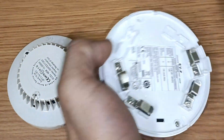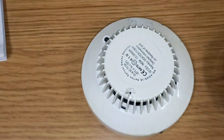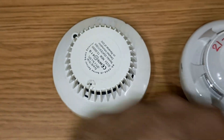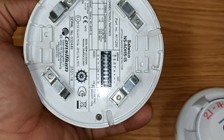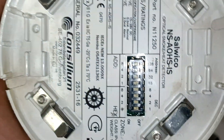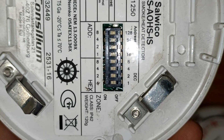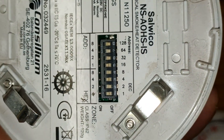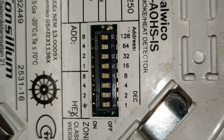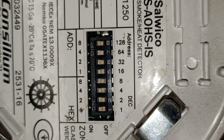These are two fire sensors — one is a smoke sensor and the other is a smoke plus heat sensor. If you look behind each sensor, you will find some DIP switches. To change or set the address, you need to understand the DIP switch settings. There are eight DIP switches numbered one to eight, with values on the left and right side: 1, 2, 4, 8, 16, 32, 64, and 128.